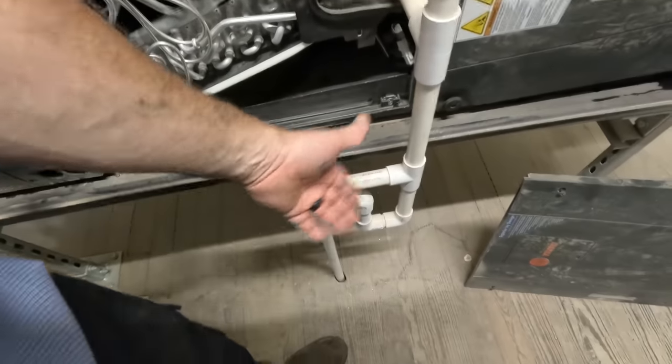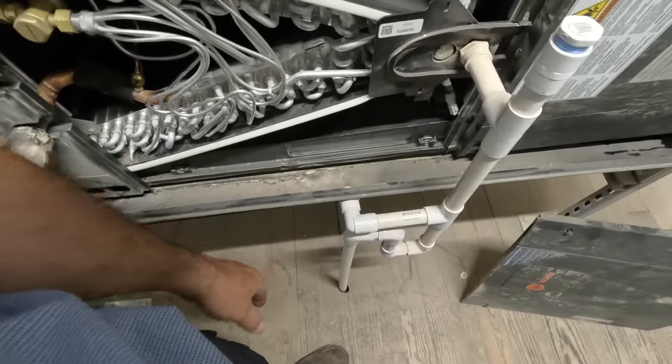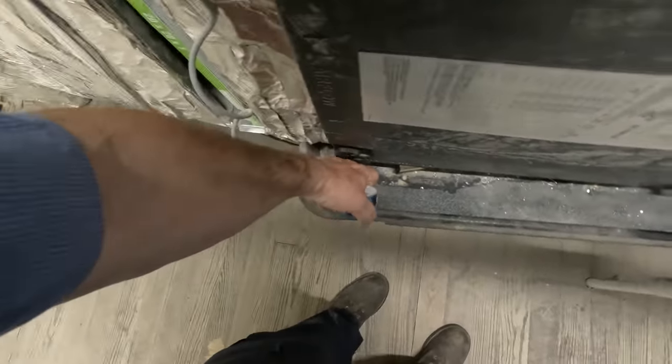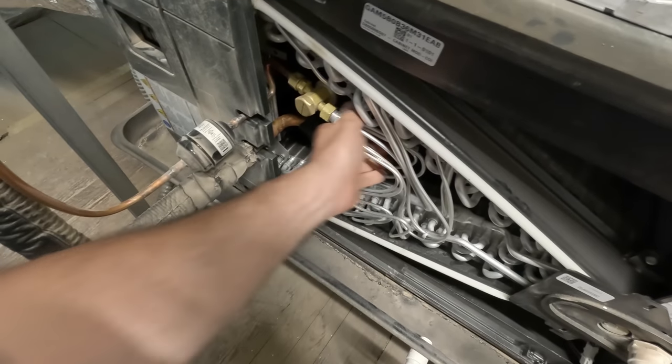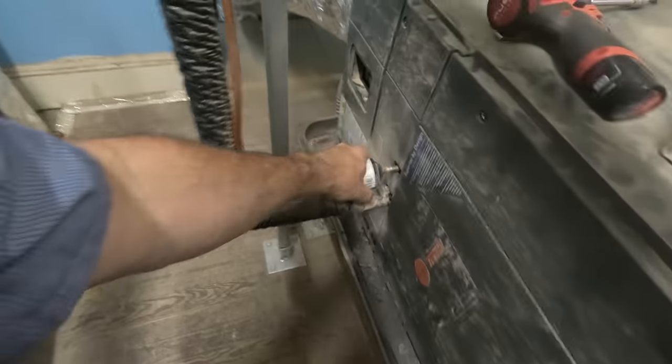It's kind of stupid - what's the point of an overflow pan if it's going to go in the same drain? Generally you'd run it to another place, because if it's plugged anywhere it's going to plug up here in this trap. It just must've got lucky - that's probably why they laid it over here in the corner. It just finally kicked on out of time delay. It's warm on the dryer, cold on the suction. Let's put her together and see if that helps take some of the heat out - so we got one working.